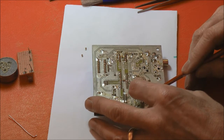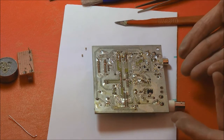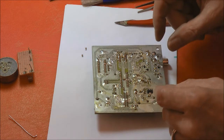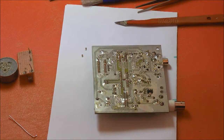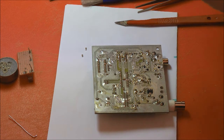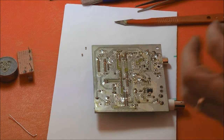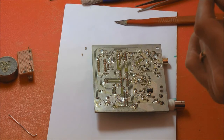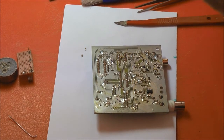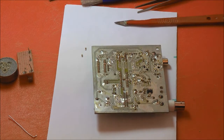Don't you just use paste and a heat gun or something? You can use solder paste and a heat gun, depending on the board. We used to use a process which was all surface mount, and you actually put the board on a hot plate and heated it from the bottom, and then the paste melted and the components kind of found their place. Some components will literally pull themselves into position as the solder melts, like a meniscus effect, and it'll grab either end. As you heat it, you'll see a capacitor that's sat crooked, suddenly doink, and it pulls into place.